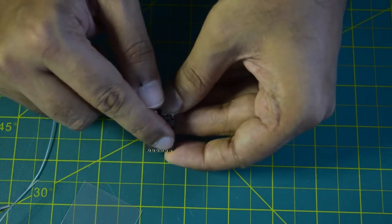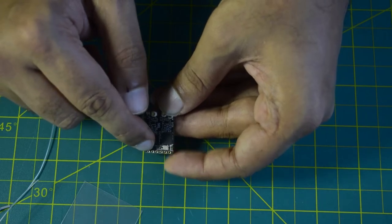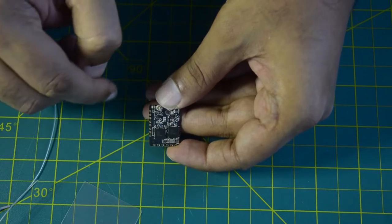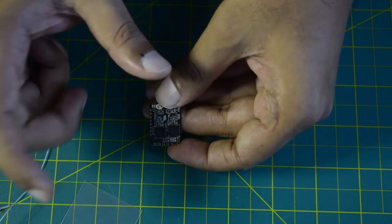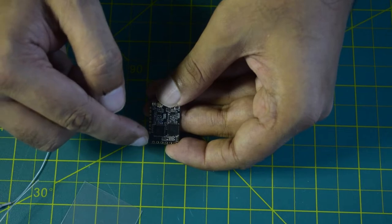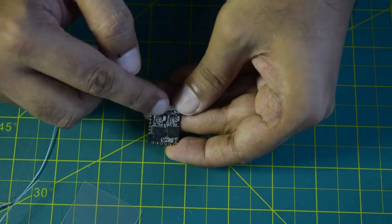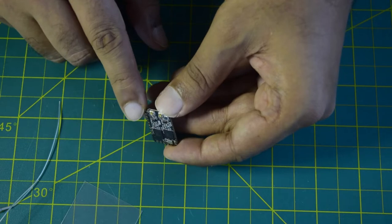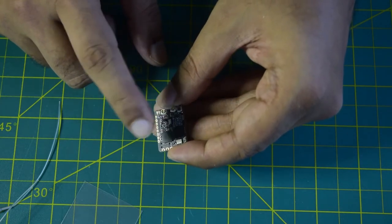So it is important to not only connect your radio transmitter and receiver but also connect your MavLink, so that whenever you enter into the failsafe mode, your extra battery which is connected onto the radio receiver, guys, will be able to keep your flight controller on for some time so that it reads the sensor values and sends them using the MavLink onto the radio transmitter, guys, which in turn will be transmitted onto radio receivers so as to be able to locate your lost drone, guys. So this is the unique feature, guys, which is offered by this TBS CROSSFIRE DIVERSITY NANO receiver.